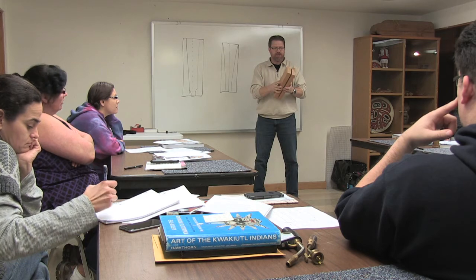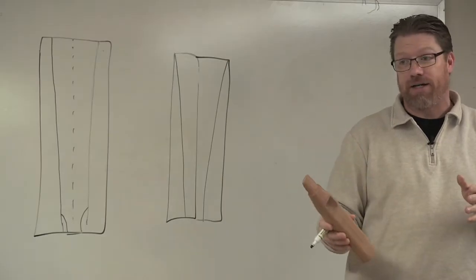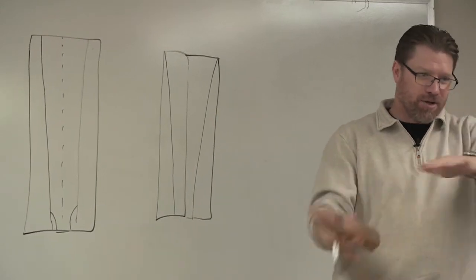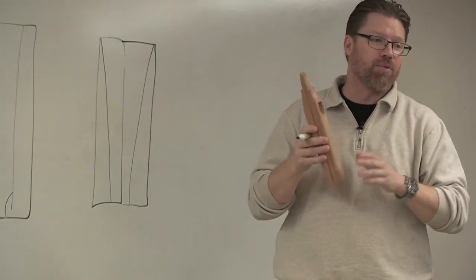I had my son plane these for me. I cut them a little bit big. I know they're 4 inches wide. I ran them through the table saw. For these whistles for you guys, I selected some fantastic wood, and I turned the log up on the sawmill to make sure we were quarter sawing it. It's all vertical grain going this way. For red cedar, this stuff is going to carve really nicely.